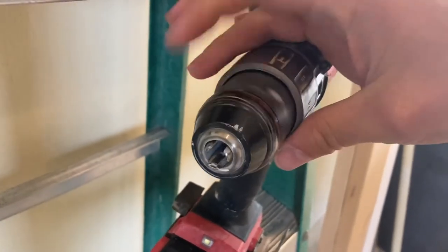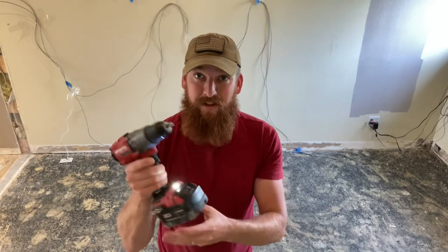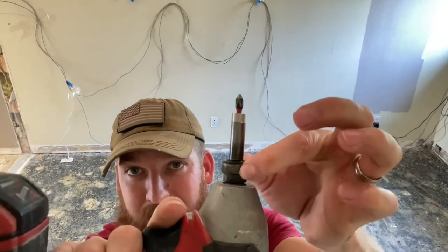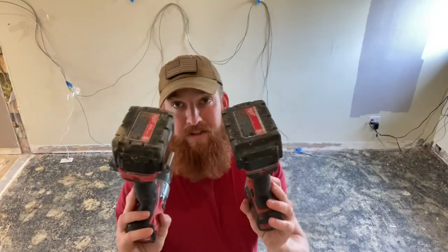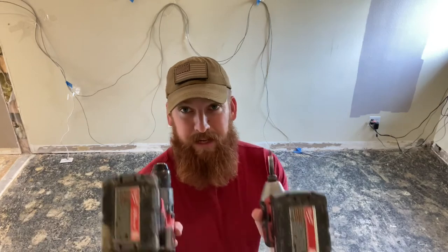So I can spin this all the way back or forward — or you can just grab the end of it. If you do the forward direction and pull the trigger, it'll tighten the end. And then you push the little lever on the side to reverse, hold the chuck — they call this the chuck — push the trigger and it'll open up nice and wide so you can stick anything up to a half inch in there. The way you change the bits on the impact is you have the little sleeve on the front — you pull it up and the bit slides out with a little retainer clip. And then also these have a light on the front, which is nice when you're in a tight space in the dark so you don't have to hold a flashlight and the tool at the same time. These are both cordless, powered with the batteries on the bottom. That is by no means a full explanation, but that's the difference between the advantages of having an impact and a drill. Thanks for watching and I'll catch you later.